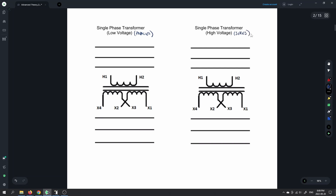As I go through, you're going to see some unusual voltages as an output. That's because in our shop we only have one supply voltage — 208 volts available. We don't have 600 or 480. So we're going through all configurations based on a 208V supply, meaning some outputs will be strange: 69 volts, 138 volts, 240 volts. Funky voltages strictly because of our single supply.